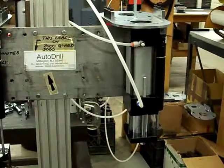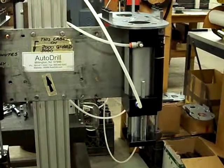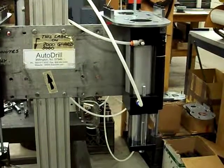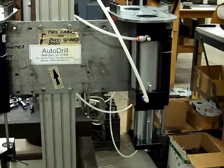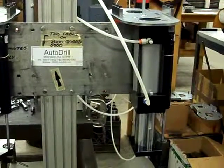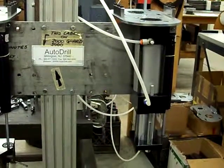I won't try and go any slower with the hydraulic feed control. At that point I have to adjust the flow rate with the meter-in feed control and the air pressure. I try not to touch the air pressure — my primary is the meter-in feed control.